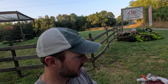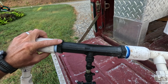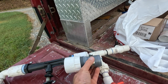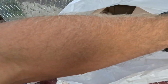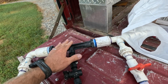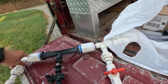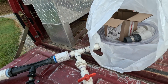This is a Mazzei injector, just like the one on our filters except much bigger — this is an inch and a half Mazzei. I don't necessarily need one that big but that's what I've got. I've got some new hose, hose clamps, and couplers so I can put this in-line right there at the field. There'll be a gate valve here so I can slow the water flow down and force water through the Mazzei and inject it into the system.